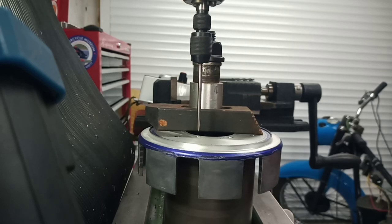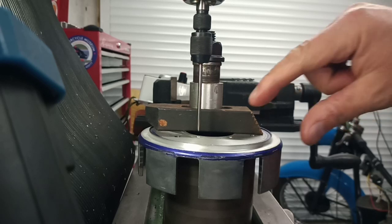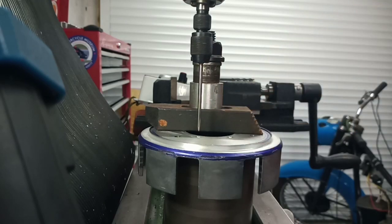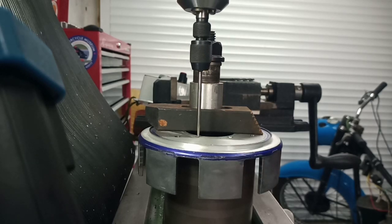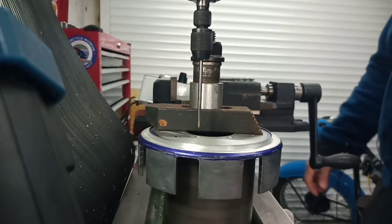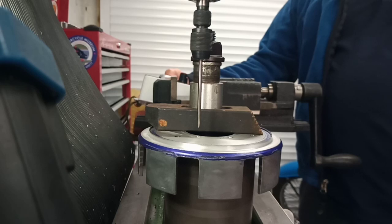And that's why we're going to countersink it at 4 millimetres and then open out our hole size to the 4.8, because if we countersink at 4.8, we'd go off the edge of our material. We'd end up with too big a countersink. But we can get around it, which is good. So I'll get this switched off, get a drill bit in there, and we will drill a hole.